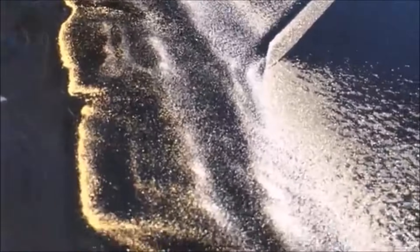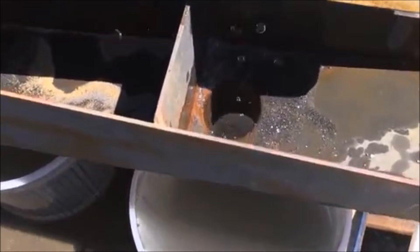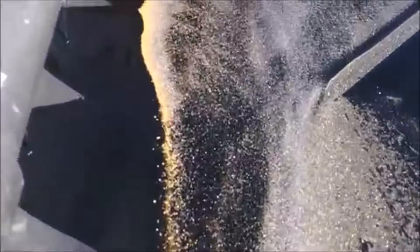It just makes a real nice line of gold right down under the water bars and into trough number one and number two high-grade port. These are the bigger pieces from the ore, and up here is actually fairly coarse material as well. Then further up we get into very, very fine gold — call it micron gold, call it flour gold. When we screen this, a good part of it will go through a 325 mesh screen.